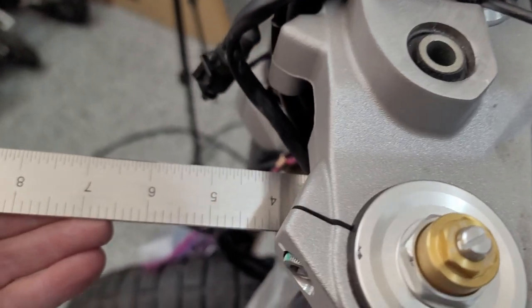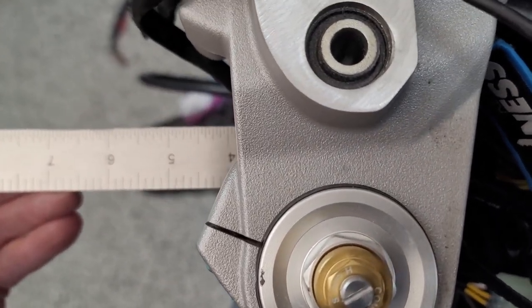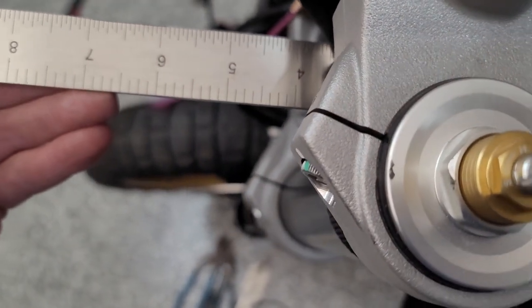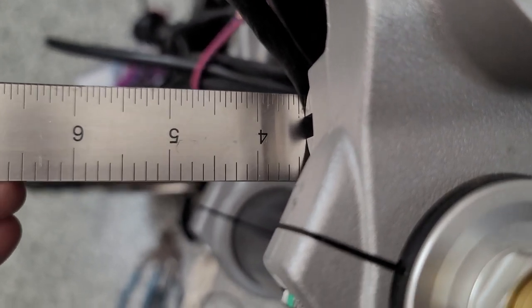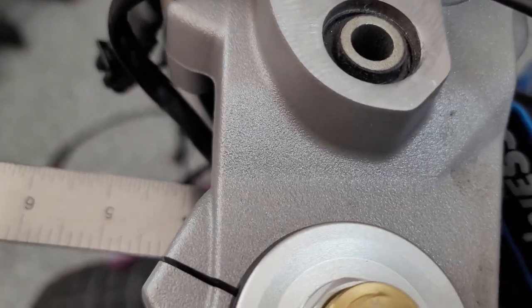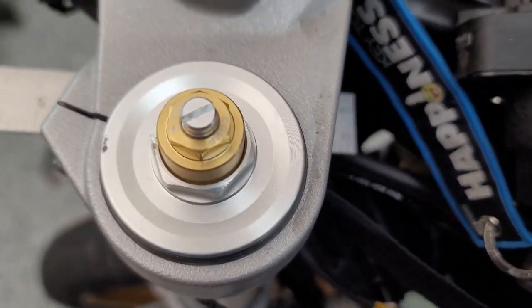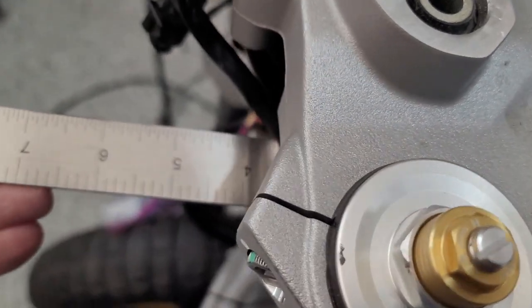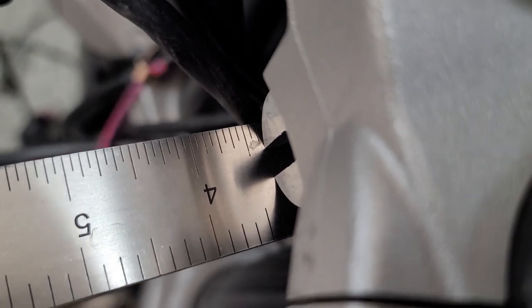Trying to do this one-handed is not really that easy, but both sides are strapped so it's as rigid as I can get. I'm using my camera as my eyeball. That large hash mark is three and a half — I keep sliding this thing. Okay, it's just right there. Putting the ruler bisecting the half of that tube and getting it parallel — it's basically just shy of three and three eighths. So you can see my method of doing it.